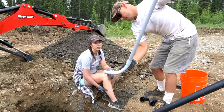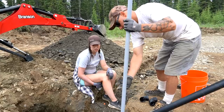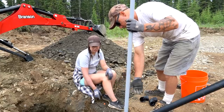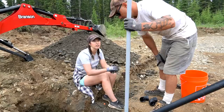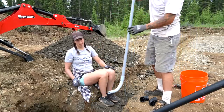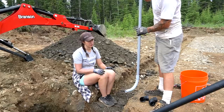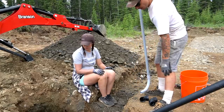Like this. That's an elbow. This is an elbow. That'll go down there, like that, and then we'll cut this off like a foot. Okay. A foot above. We'll cut that one off a foot above. Sometimes I've seen people have elbows for some reason sticking out of the concrete. That's usually where like our PEX is gonna go. All you do with our PEX is you just run an elbow with like a little piece like that, and then it just ends. It just goes into the thing. But let's get that one cut.